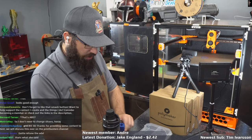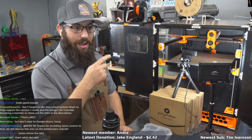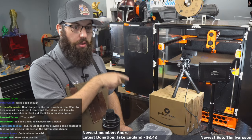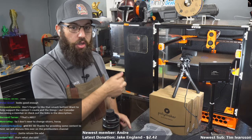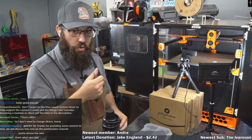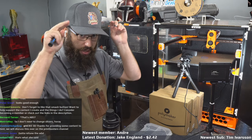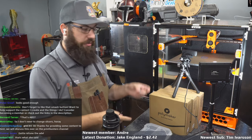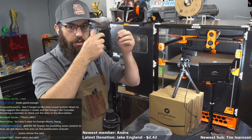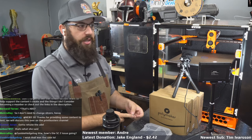Extrusion width is, your slicer knows what size nozzle it has, and your printer knows how many steps per millimeter to push X amount of filament. So if you tell your slicer, I want to extrude 0.72 millimeters of filament for infill, it converts that when it spits out the G-code, you need to push this much filament. It calculates it all and it pushes out. This is how many steps we need to move this much filament through a 0.4 nozzle to make this much extrusion width.